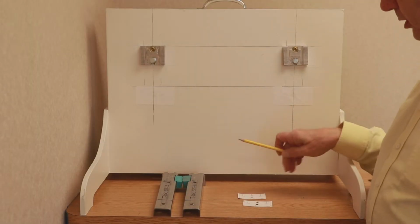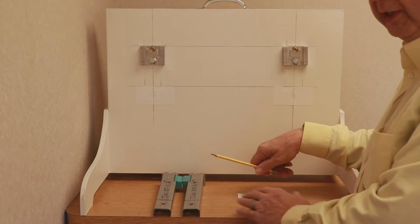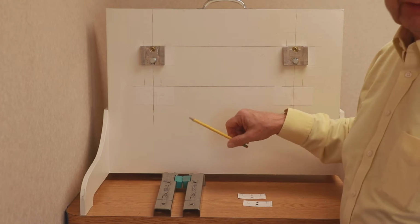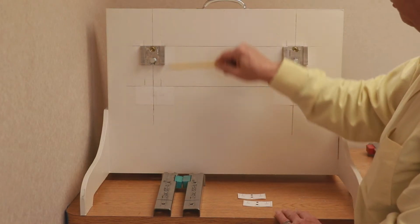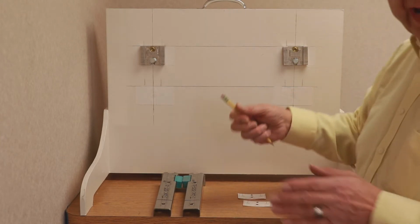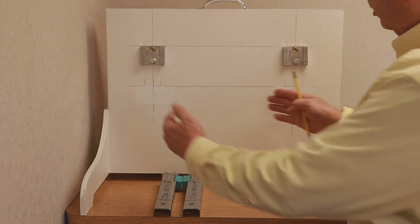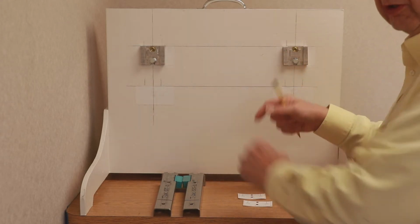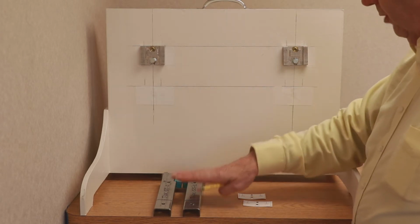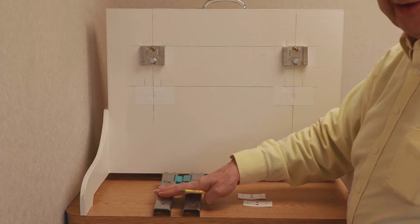The first step in installing these brackets from ShelfMade for floating shelves is to locate your studs and get a line on the wall. You don't have to make as much mess as I did, but get your line on the stud. The manufacturer recommends a maximum of 32-inch spacing on these. In this particular case, we're at 16 inches, but a maximum of 32. And the rating for this one is 150 pounds per bracket. Pretty hefty load that it'll handle.